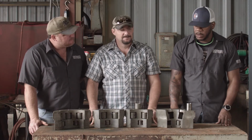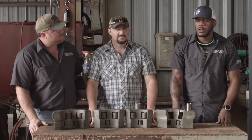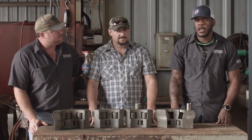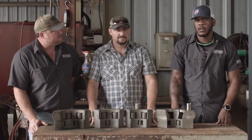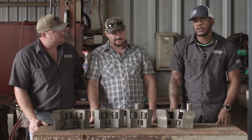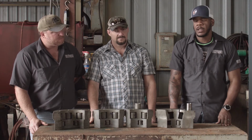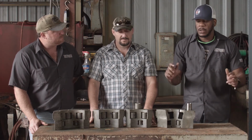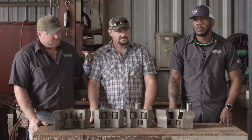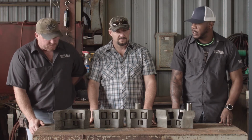We're going to increase the size of that stand elevator to handle between 2 and 3 million pounds, basically retrofitting existing deep water rigs with our elevator and outfitting new gen rigs being released with our elevator. It'll be a plug and play system as far as hydraulics are concerned. We'll probably have to bring someone in to assist with a little bit of integrating it into iron roughneck systems and driller shacks. But for the most part, the hydraulic ports will be there to plug in and operate, tilt, compensate, allow free spinning, et cetera.